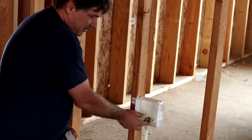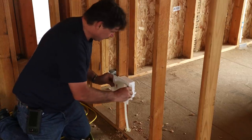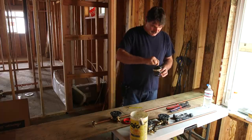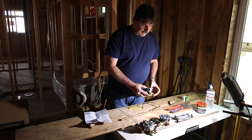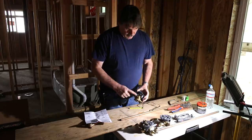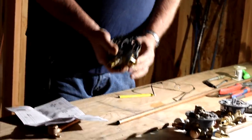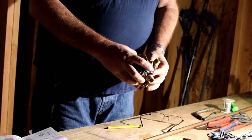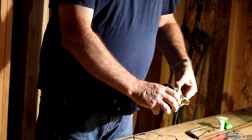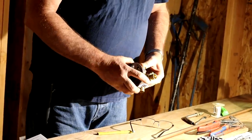Keep in mind that any time you throw something up, shut it off — you won't get the surprise later. We're going to sweat copper pipe to this valve. It comes universalized or you could put fittings on it, or you can solder copper pipe right into the valve. You've got to remove some of the plastic and there are shutoffs on there with a little screwdriver shutoff, so you can work on the thing without shutting the whole world off — go to the store, get parts, and still have water in the house. That's a really nice feature on any shower valve.